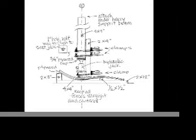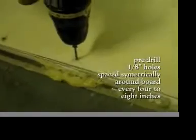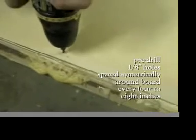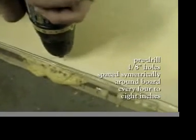The jack actually creates downward pressure that forces the laminates to bend the kick tail and shape the camber underneath the board. Here's a look at the center line. You're going to use either decking screws or drywall screws around the perimeter, not driven in too tightly — you don't want to bend the wood in the other direction. Here's the completed jack assembly. You'll notice that all of the pressures are vertical, everything is pushing up into the bottom — there you see the bottom of the post.